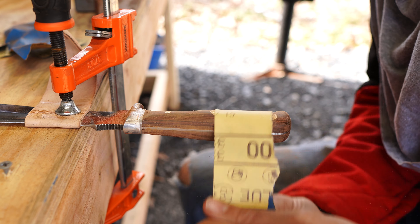Now given the rough compound we just used, we still have some polishing to do. If you leave the blade all rough like this, all the tiny grooves will collect moisture and really start to foster a lot of corrosion. So now we'll be moving over to the other buffing machine, using a wax-based compound that has a super fine grit in it. The purpose here is to remove all the scratching from the previous buffing compound and give the blade a nice smooth sheen.